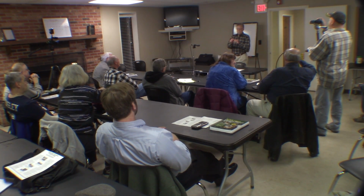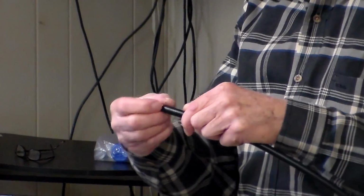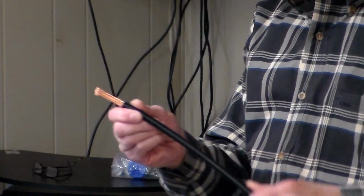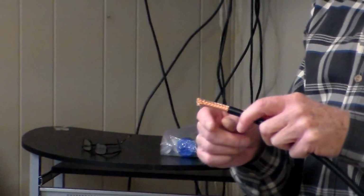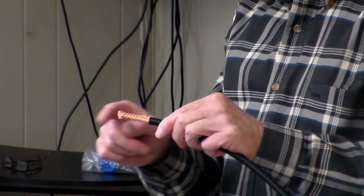I will take the sheath back, probably about that same distance, and do not disturb the braid at all. And I will tin that entire length of braid solidly with probably a 140-200 watt gun, which is about the best wattage that I have found for doing that. There's a little bit of a trick to it, because you want to keep moving with it once you get it hot, because if you don't, you can melt your center insulator, whatever it is, especially foam. But anyway, I tin that completely,